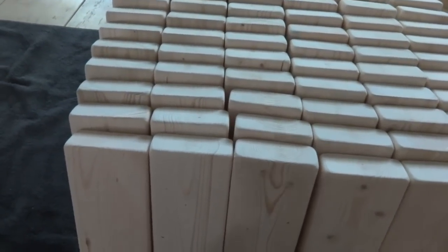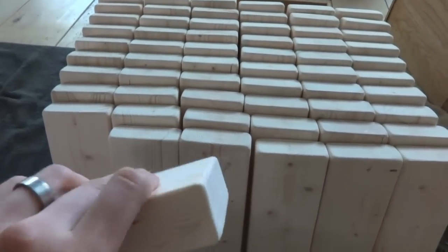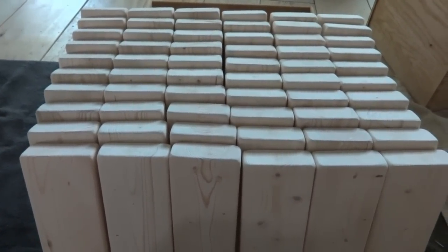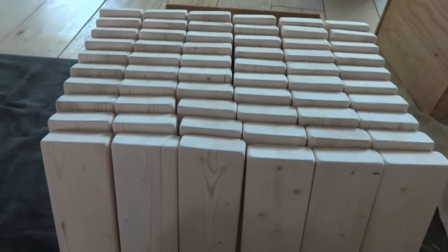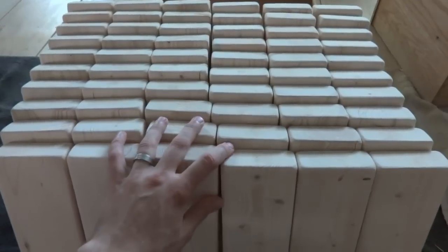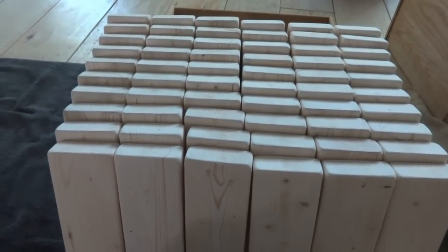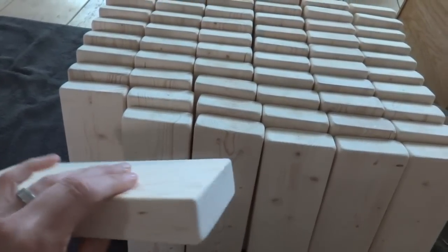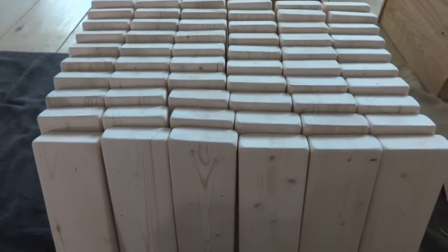Here's all 60 pieces — they're nice and smooth with nice little rounded edges and a kind of silky texture. Halfway through I ran out of 60 grit pads for my orbital sander, so I ended up using 80, and I found that was about the sweet spot. I didn't have to do every single one in 60 and then again in 120 like originally planned — I just finished them all in 80. So the 80 grit seemed to be the sweet spot; you probably don't have to sand them twice.